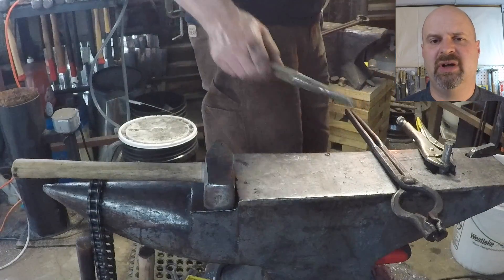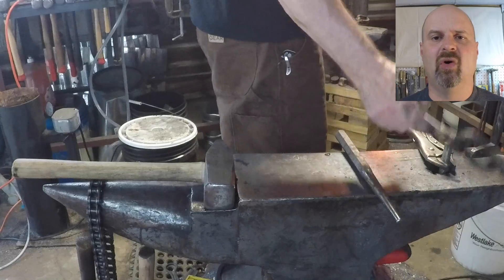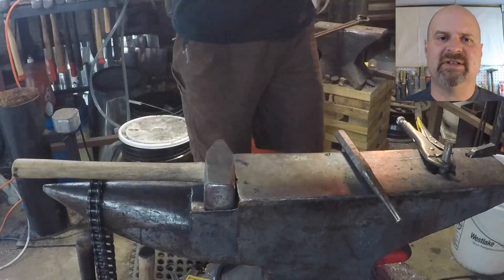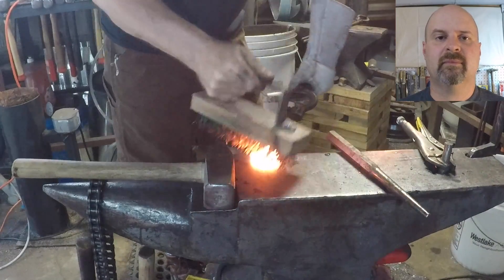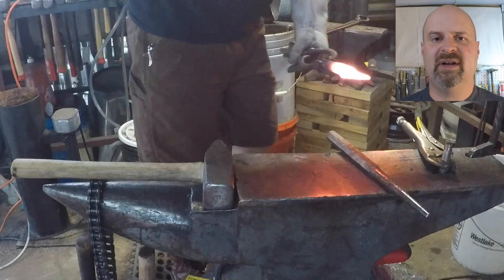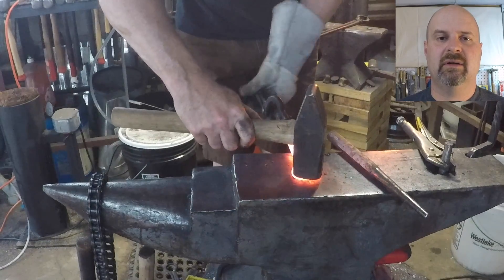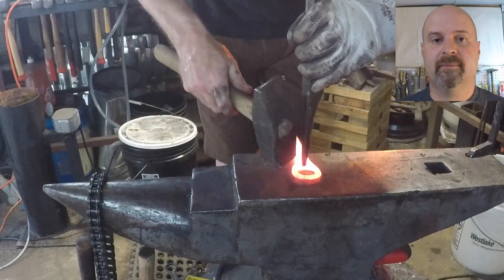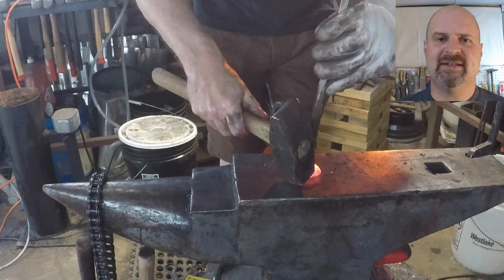That's kind of a ball-nosed punch — it's smooth around the edges, not square and sharp, and it's not for drifting a hole through. It's for starting the first mark where the tab for the opener will be, the little top. I'm going to get everything good and clean. I don't want any scale in there when I'm trying to get this in just the right place. I'll make one mark and check it to make sure it's just right before I set it deeper.